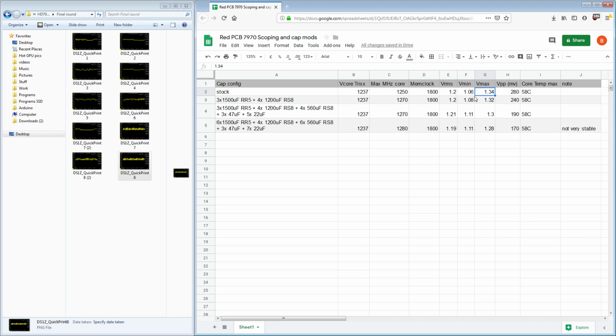So yeah, definitely this should improve tolerance for extreme voltage on sub-zero. At the same time, there's also the whole issue when you're sub-zero that you have temperature effects to consider. Just because your silicon won't suddenly die at high voltage doesn't necessarily mean it'll overclock better at high voltage, right? Those are two different things. Just because you can run a lot of voltage doesn't mean it'll clock better.